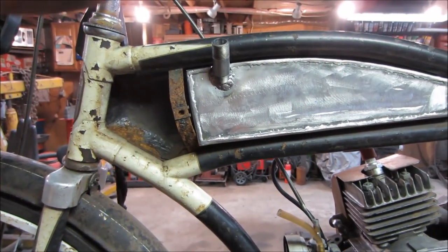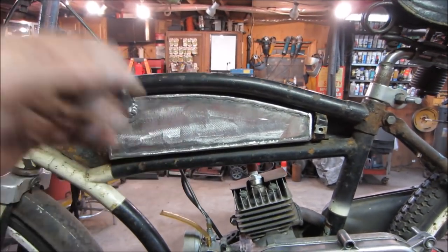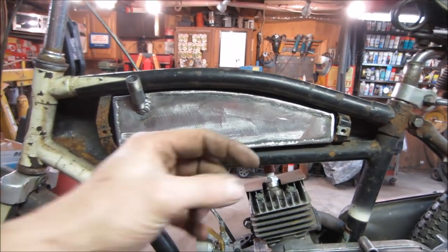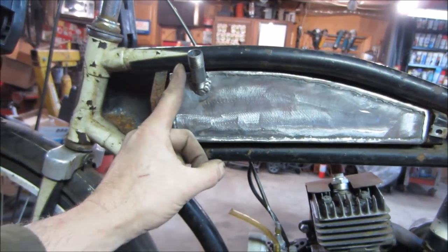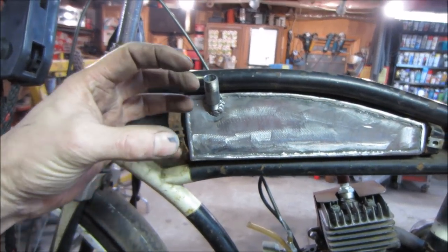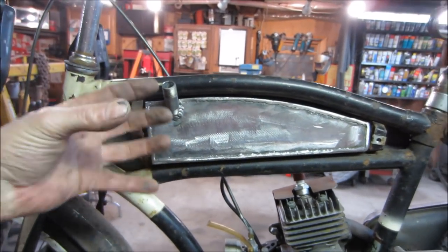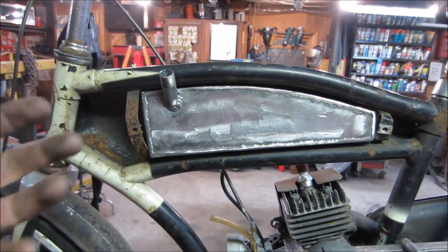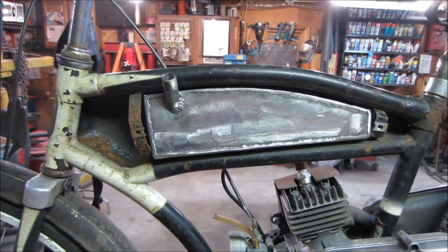And then we'll just have to probably notch the bottom of that cover a little bit more. For isolating it, to keep it in the center, I may just go get a pack of rubber bands, and I'll put them around, say, here, and maybe right here. I'll just keep adding them on until it gets snug in its area, and then when the two halves get squeezed together, it's going to be dampened all the way around. It won't rattle, it'll have protection, and we can kind of adjust it if we need to. So let's see how that works out.